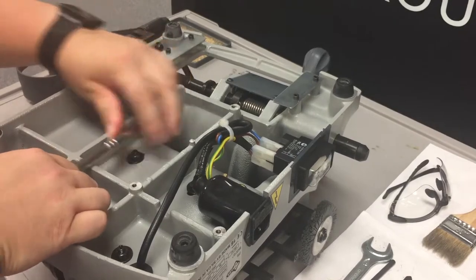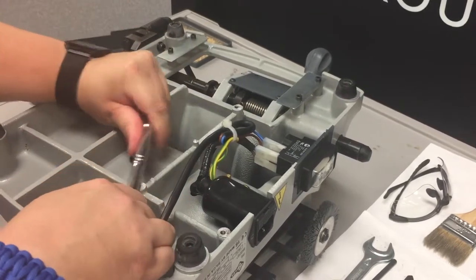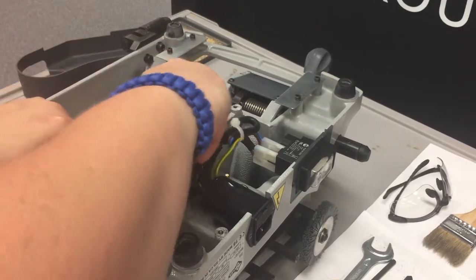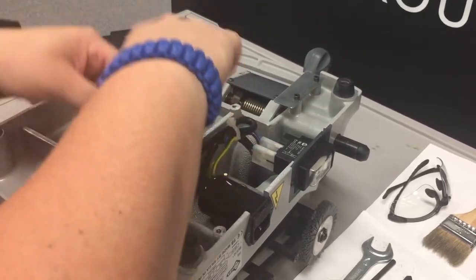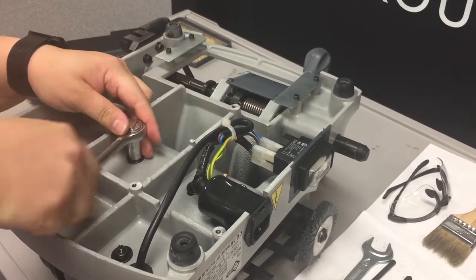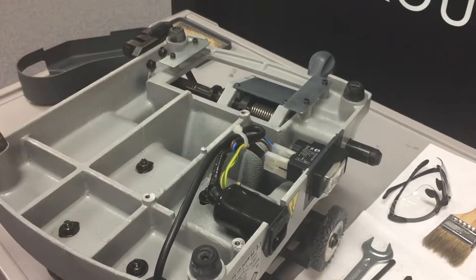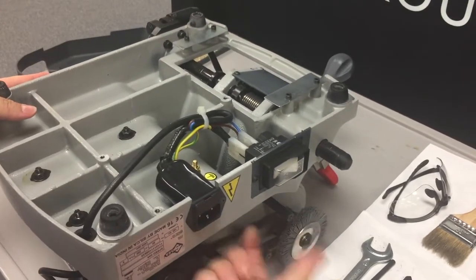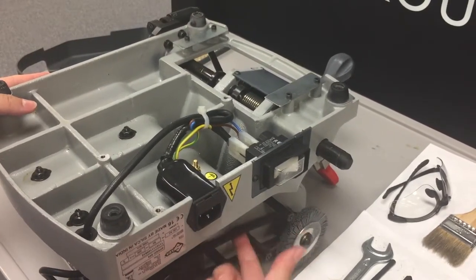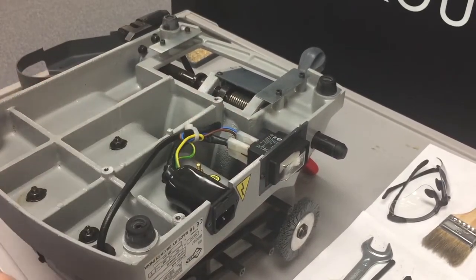Now, since these are holding the motor in place and it will be incurring a lot of vibration, you do want to make them very tight. All right, with those four tightened back down, check the tension on the belt. It should kind of flick like a guitar string. And now we can replace our metal cover